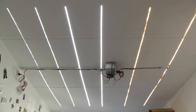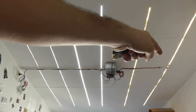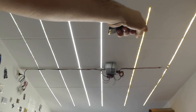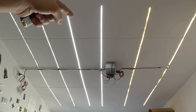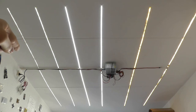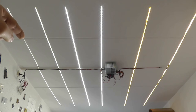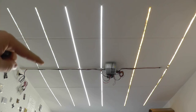This light installation is already two years old. You can see the LEDs have faded — not uniformly. Particularly on the warm white strips, some LEDs are less bright than others. On the cool white strips the color changed significantly: they should be around 9000 Kelvin — bluish — but they're no longer blue. Over two years the blue component simply faded away.